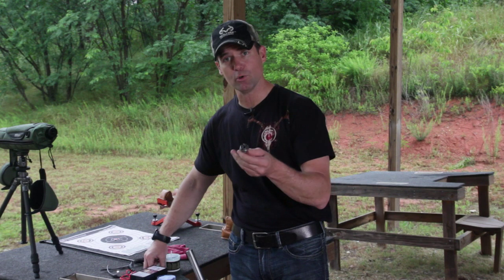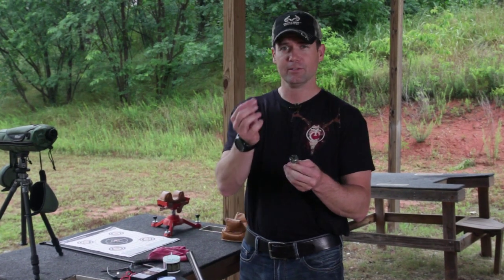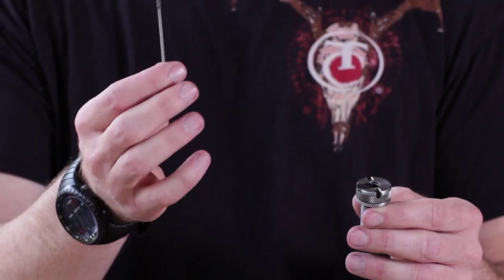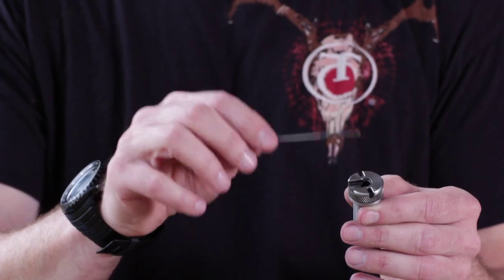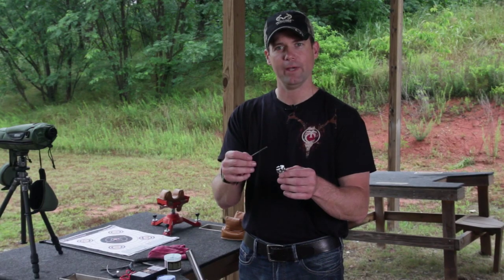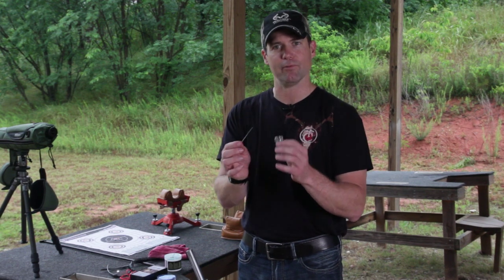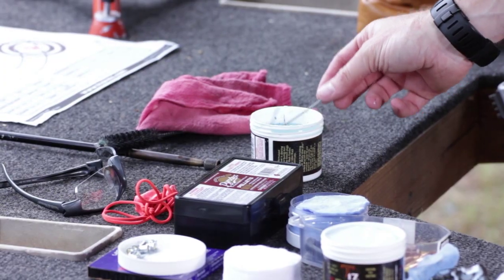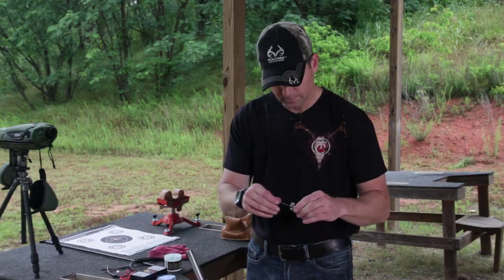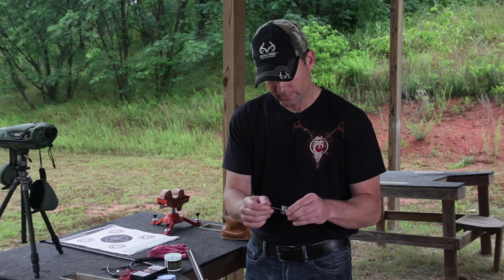But here's the area most people forget — I'm talking most, meaning 99% of people. This is a flash hole brush. This flash hole brush cleans the flash hole channel inside your breech plug. What happens is your primer goes off and puts a carbon residue inside your flash hole, which starts to clog up over time and will affect your accuracy and reliability. So I'll put a little bit of bore cleaner on it and go in there.